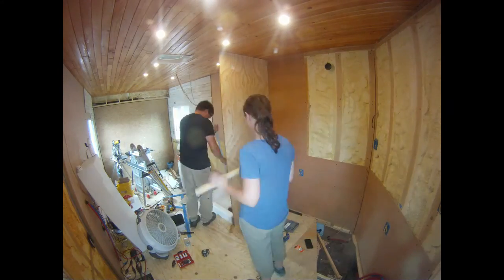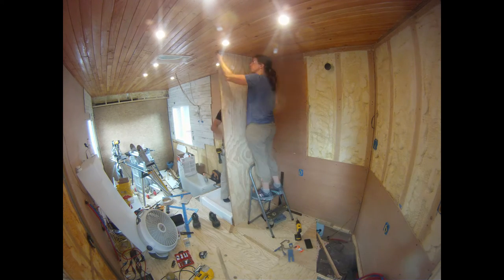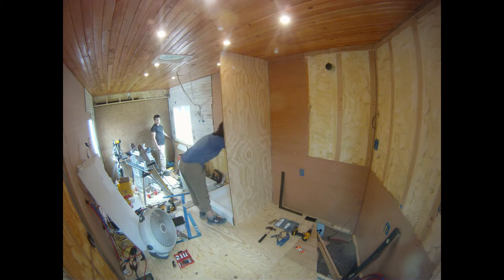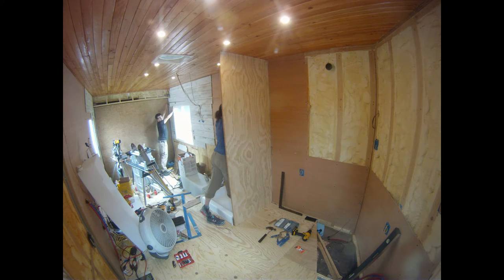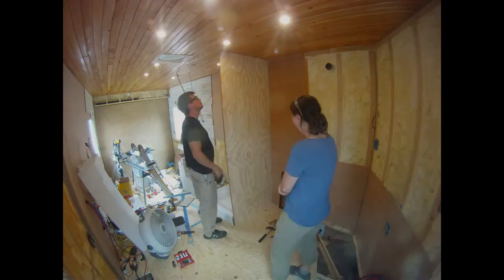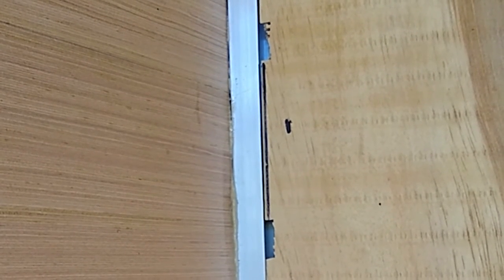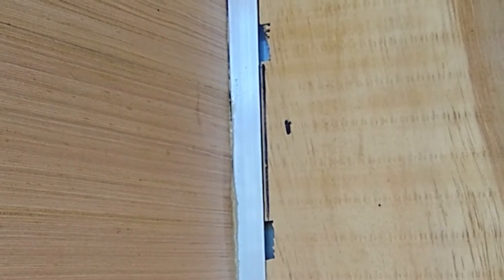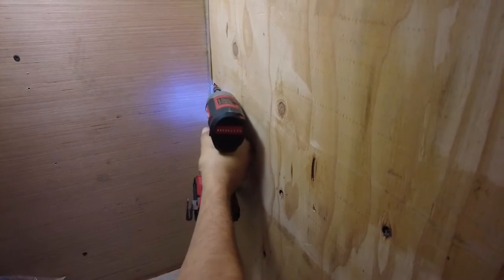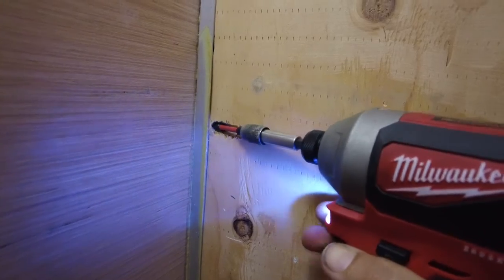Our intention was to slide three-quarter-inch plywood into the C-channel and only secure it to the ceiling and the floor. We finished installing the wall in the cool of the evening. While working the next day, we discovered that the sun heating the outside of the trailer caused significant expansion and had pulled the walls apart. By spraying the outside with cold water, we determined the walls had separated more than half an inch. We decided we needed to screw the two walls together, so we added multiple pocket holes and shot screws into the C-channel.